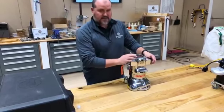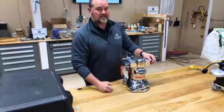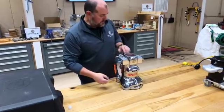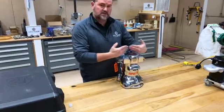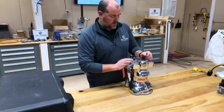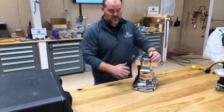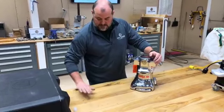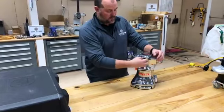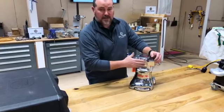I think the first set of Super 7s that came out were two-pole motors, but these are all four-pole motors. We see that a lot in the shop where the two brushes in the front and back and the rear vent get changed, but the side ones underneath the switch access plate never get changed. If you have a 7R, you have four brushes to change out. You want to change your brushes when you start to lose power — you can feel that, you can probably see it when it's arcing a lot. You'll see welding-style arcs come out of it. If it's lighting up a dark room, it's time to change your brushes.